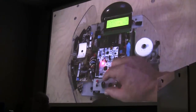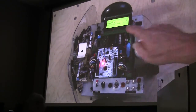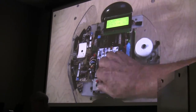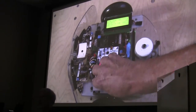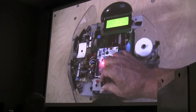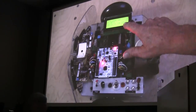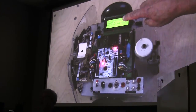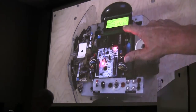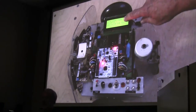67 or whatever. I mentioned that there was a knob associated with the second A to D channel. And if you look down here, it says the knob is currently at 33. The knob will go from plus 1,000 to minus 1,000. And so if we said, well, I'd like the delay to be 525, but I don't want to have to count up to there, I can just hit the enter button and it says, do you want to write the knob? And I say, yes. And so it'll write that value.